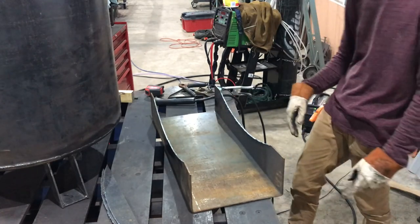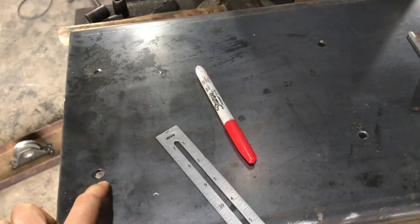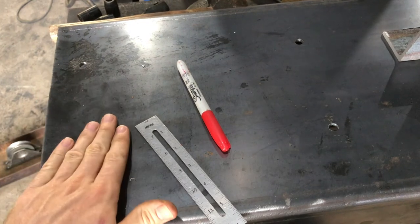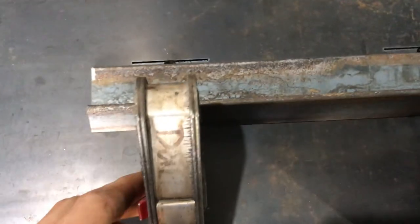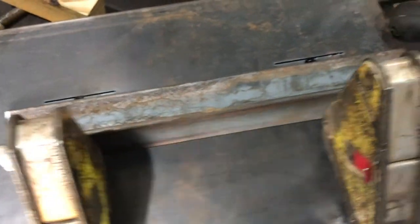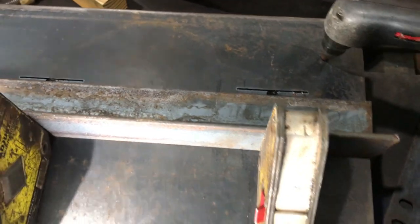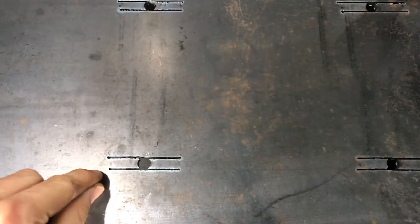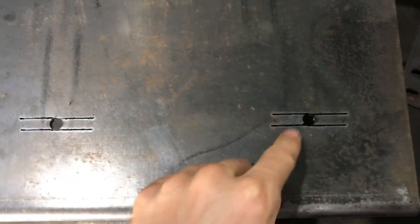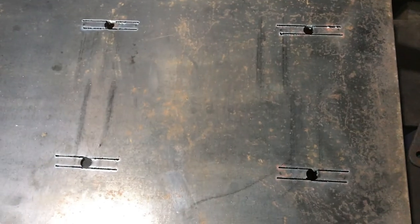This will obviously need a little cleaning up — knock some rust off. I marked out and center punched where the compressor head goes. Over here I used a piece of angle iron and used magnetic squares to hold it in place. I got it adjusted and did the groove slot so you can move things out of the way. There I have the slots which I just have to cut to finalize, and then I'll have the groove so that the motor can slide back and forth to adjust for the pulley.